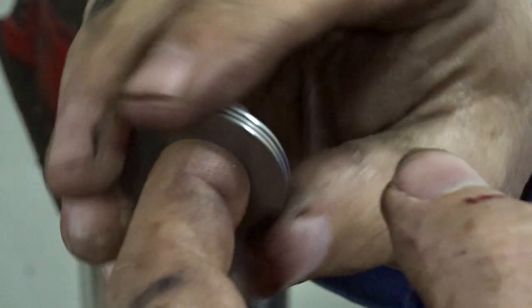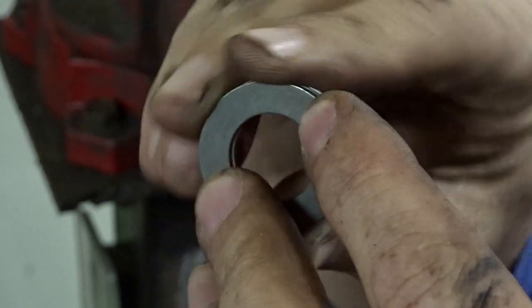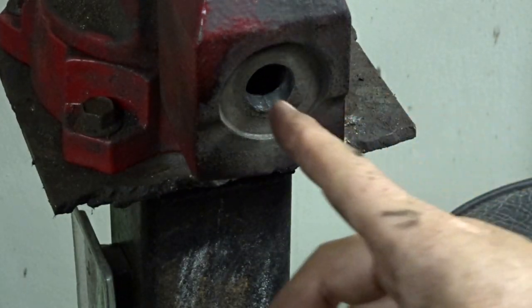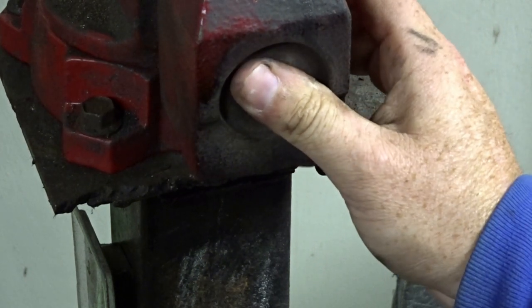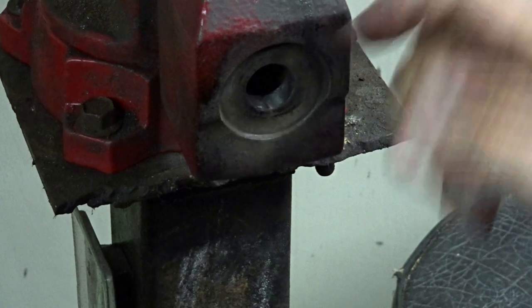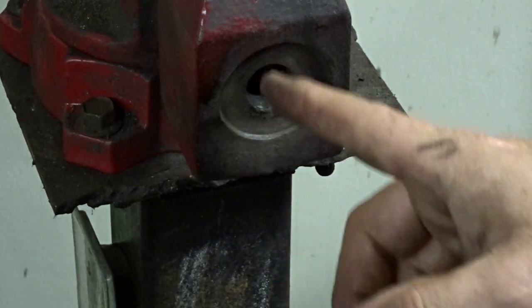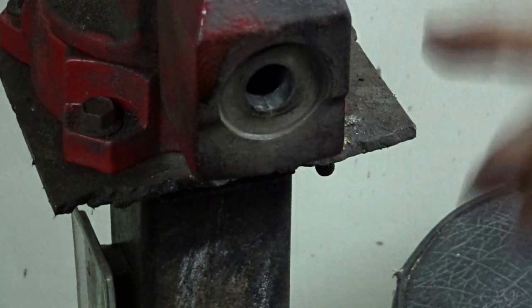With this type of bearing, most bearings load from the top, but the load on this one is front and back — you can put a tremendous amount of force on this and you'll be just fine. So whenever we crank that acme screw in there and it gets pushed up, it's sandwiched in there. As much force as you take to push it down, it's going to take that much force to release the pressure, but with this bearing it should allow us to put as much force as we want in, and when we release it, it's rolling on that bearing so there shouldn't be any friction.